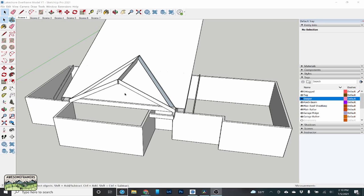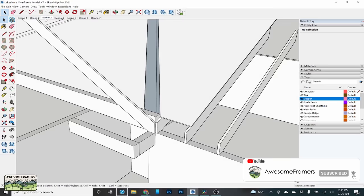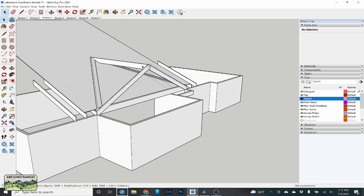Now let's get into the math and theory. You're looking at a garage ridge that spans across the porch — that's a 7/12 landing on top of a 5/12. The sleeper lands on top of the sheathing, we have a 7/12 rafter, and here's our five-and-a-half by 15 glulam. This is why we call it an over-frame roof — the 7/12 over-frames on top of the 5/12. We call them California valleys here, and all the jack rafters from the ridge to the sleeper are called California jacks.